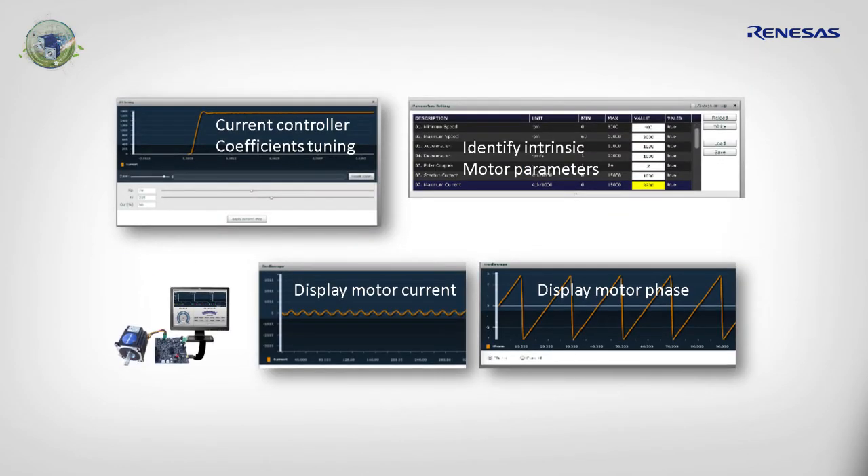The algorithm is a full closed-loop vector control software. We are using either sensorless or sensored approach and several types of flux estimators are offered. We deliver a long list of motor parameters that we tune using these types of kits. The reference platform is delivered with embedded software which is able to tune automatically and calibrate automatically your motor within a few mouse clicks.